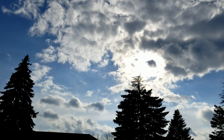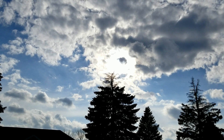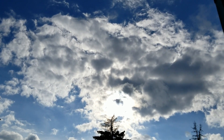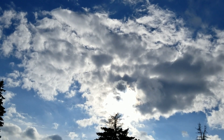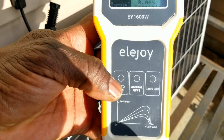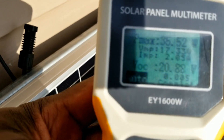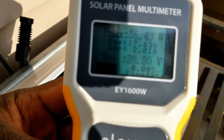The reason why the sun is fluctuating is because it's coming out from the clouds - heavy clouds right there. So it would have been a cloud edge effect - it might be helping or not helping on this test. Let's see - open circuit. I'm pushing the Auto MPPT so we can track. It's giving us 35.52 watts at the top. Sun is shining - and the VOC is 20.80.